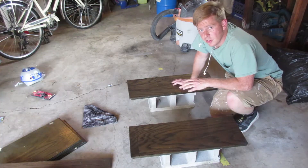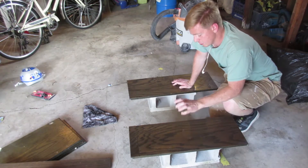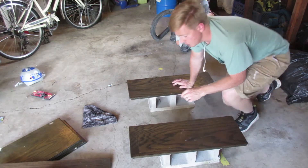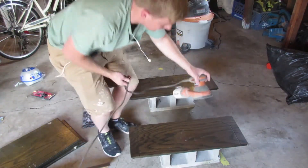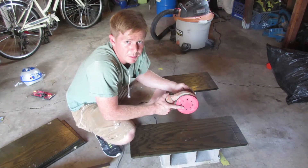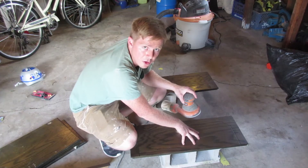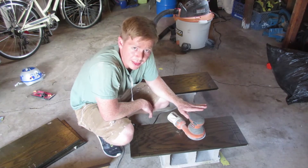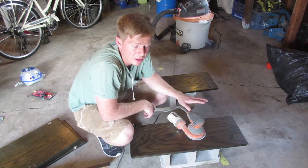In my garage, there are a few different ways you could do this. You could do the traditional stripper with multiple layers, but what I'm actually going to use is an orbital sander with 120 grit sandpaper. I can just sand off the first layer to go beneath the sealer and the stain. It's a little bit easier, and I'm in the garage so I don't really care about the dust.